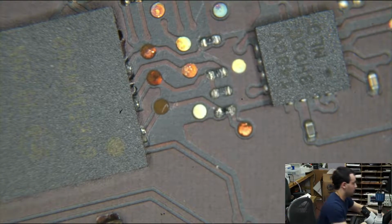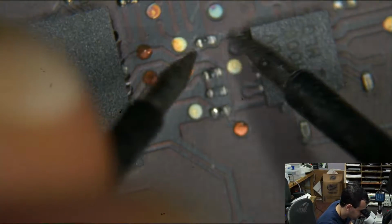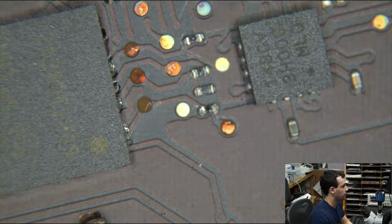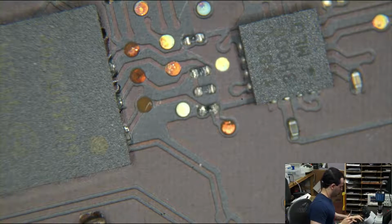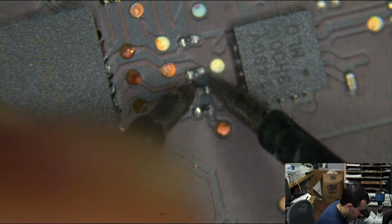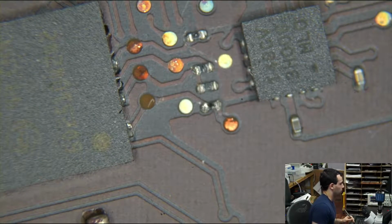Let's put it back in regular resistance mode. The 6101 is supposed to be 3.3K. That's fine. Next one. 6123. I just hit V to make that happen, by the way. Verbose mode. It shows everything in there. All right. R6123 is supposed to be 24.9 ohms. It's fine.